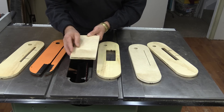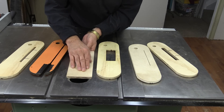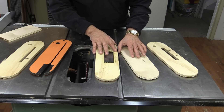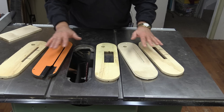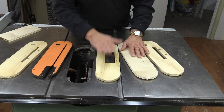For this saw, what I'm going to be using is a good quality plywood — it's a half-inch plywood. It's just slightly below the table, but I'm going to show you how to fix that later on. When you learn how to make these throat plates, you can make them in all sorts of different widths, and you can reuse them for years and years.